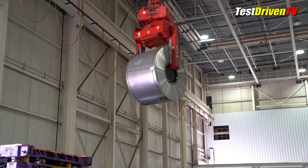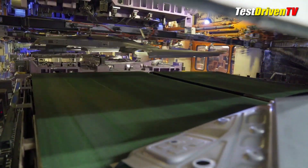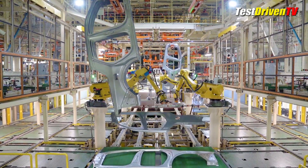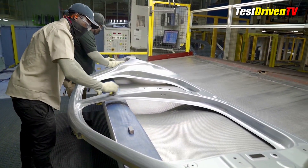The plant features its own in-house steel stamping plant where major chassis structure and exterior body panels are made on site. The side panels of the Santa Cruz are stamped out of a single sheet of steel, making them stronger, lighter and less susceptible to flex and corrosion by eliminating unnecessary seams.